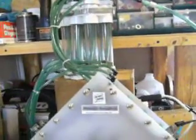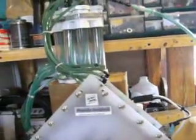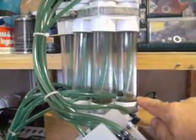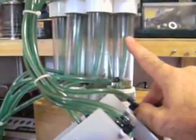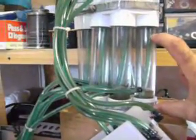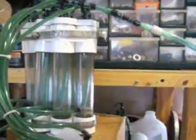Another advantage of this self-circulating design is no foam - even when it's green. There are two reasons. First, foam does come out of this top tube, but by the time it goes through the bubbler water you're breaking down some of that foam - the foam is dissipated through the natural bubbler action. Reason number two: this bubbler offers pressure head of about four inches of water. Then there's a check valve - this is a one PSI crack check valve - so already you're at a couple PSI. Pressure helps to reduce foam, so the cell runs pressurized.